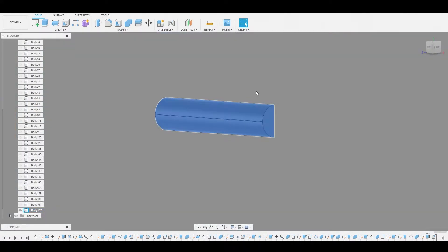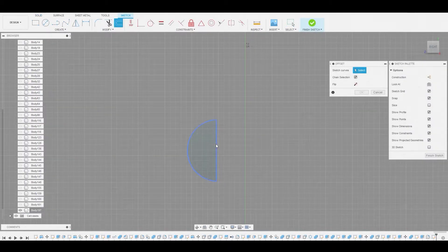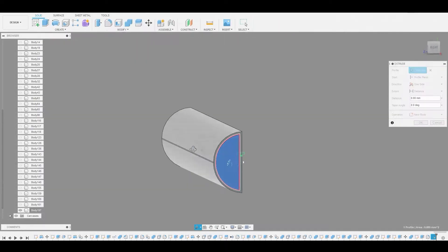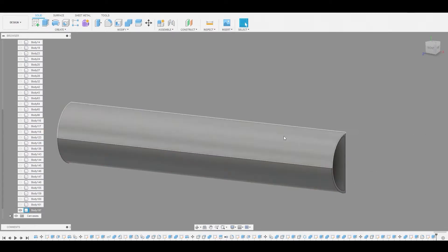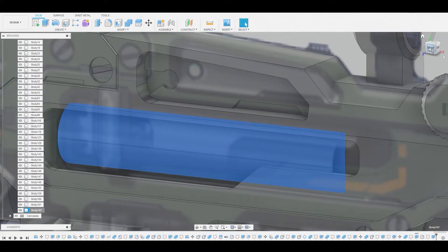Once we isolate this we can select this flat surface here and create a sketch. Let's use the offset tool here to select the border and we're going to downscale this — so what we're doing now is adding some thickness to this. We're going to hit OK and just press pull this profile all the way through the other end, and ensure the operation is uncut. Now we can un-isolate this body.